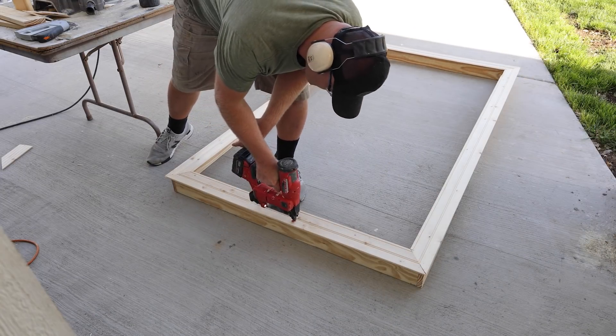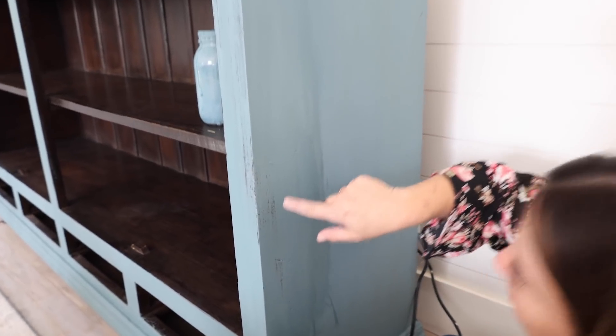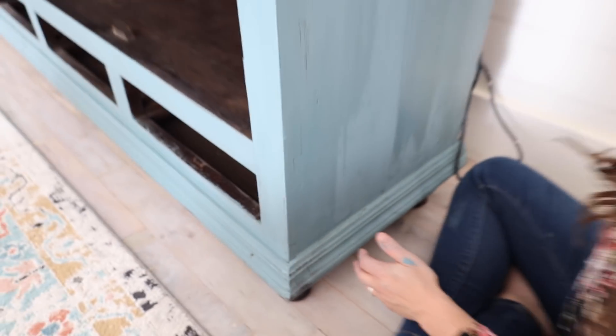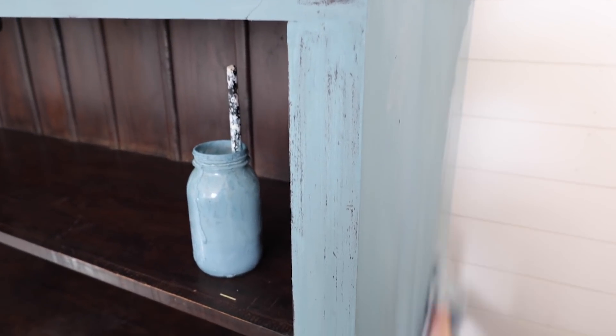Now I'm going to use an 18-gauge nailer because the 15-gauge is overkill — this is more of a finished nail. Because we're inside the house, I don't want to use the orbital sander, but I do want to smooth out the paint a little bit, so I've got a damp rag. Careful when you do this — it could activate the paint, especially if there's bond in it. If your piece is really shiny or you're worried about chipping, you can add bond to it. You can see as I rub this, it's starting to chip off. I'm just going to rub where it would naturally wear. Milk paint doesn't get streaky — it just kind of randomly chips off. This isn't an uber chippy piece, which I'm okay with, but I do want some distress. I'm going to get the heat gun. As it dries naturally, sometimes it will chip after you've wet distressed it.